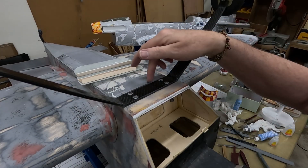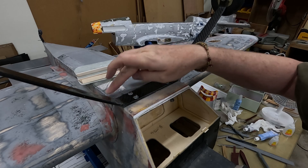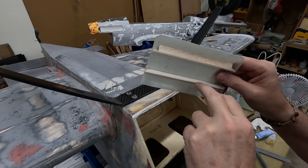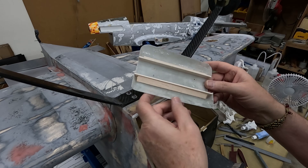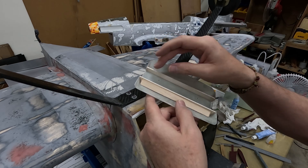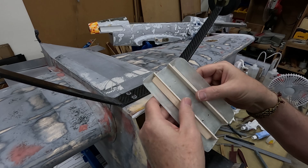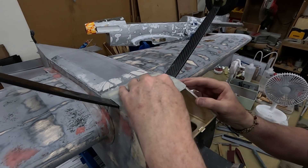I cleaned up all the foam and was able to get the last little bit of tape off — in this case it was easiest to just rub it off. My plan to use the foam as a template for these formers didn't work, so I had to do it the old-fashioned way: trial and error. Fit them, see what needed to be sanded, sand, trial, sand until I finally got it. I added a couple of gussets on each side to stiffen things up, and now it fits pretty well.